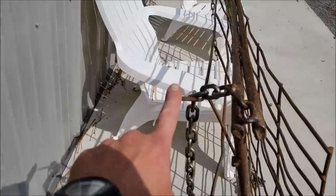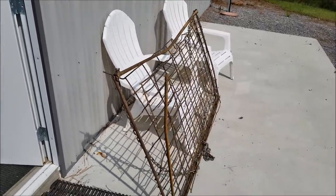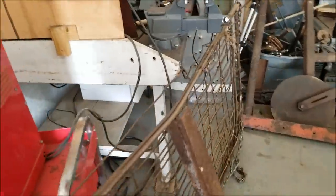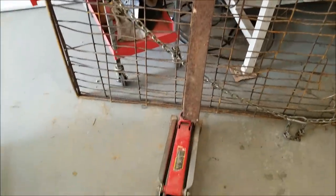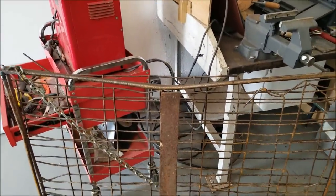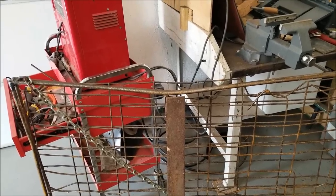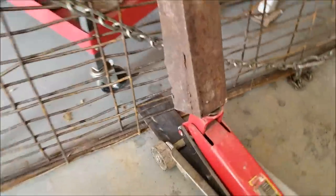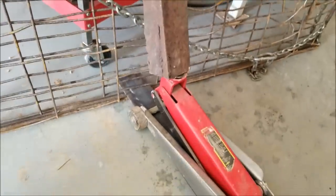I've got a lot of bent stuff up here — it's totally mangled. I'm going to take it in the shop, throw a few welds on it, and tighten it up because I still need it this year. This is how I'm going to straighten the front bar — it's got a pretty good bend in it. I've got a piece of angle iron and a floor jack, and I just have to wedge this so it doesn't bump out. I had to put a piece of stock steel under the jack so it didn't just lift the whole drag.